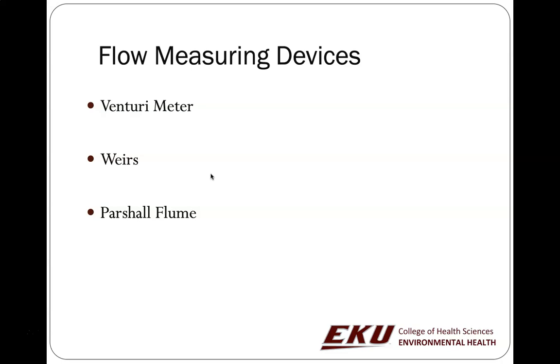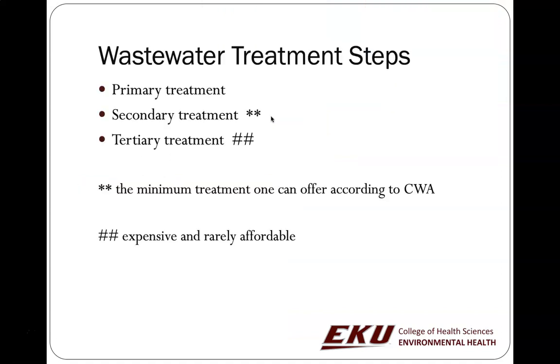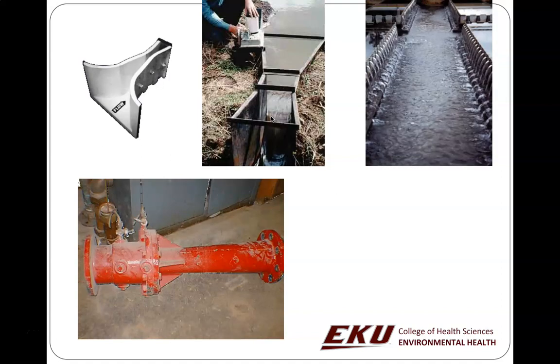There are different ways of measuring flow. There are old-fashioned ways using weirs, where you could tell how fast something is moving. Nowadays, flow meters are built into the system. When the wastewater plant is built, the engineers design it so you can monitor the flow from a distance — even from a telephone or from the computer at the office.